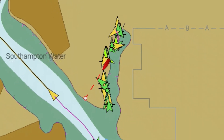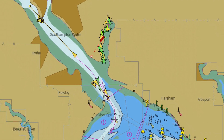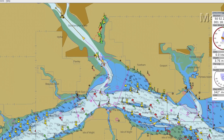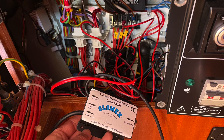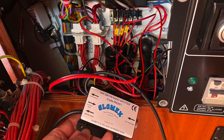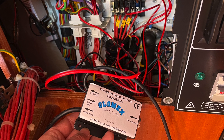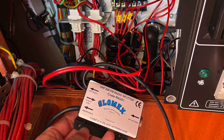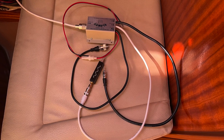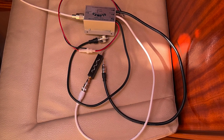In this video I'm going to complete my AIS installation by hooking it up to the boat's antenna. To do this I needed to change a component I've been waiting for - a VHF splitter. The original splitter that came with the boat splits the masthead antenna to give you an AM-FM radio output and an output to your VHF marine radio. The new one breaks the frequencies down further and gives you an AIS output as well.